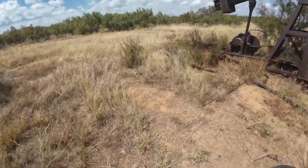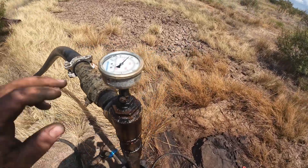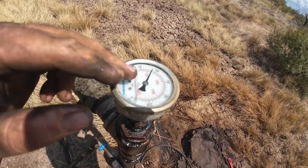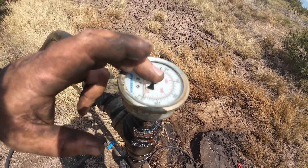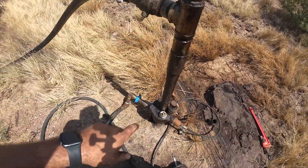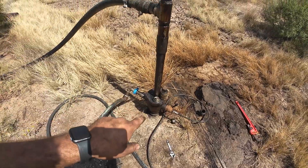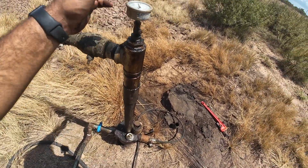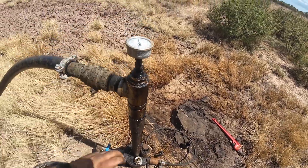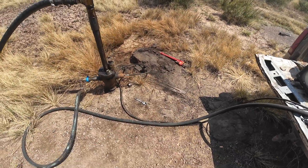I'll turn the pump off — I can do that from my phone. The pressure should fall relatively quickly and go to zero. You've got to have a pressure differential of at least 200 pounds casing to tubing, and we've got to go to at least 500 on the casing. I'd rather it just be zero so we can put zero/zero and 500 or whatever on the paperwork.